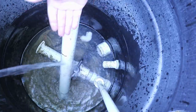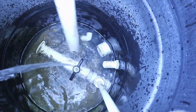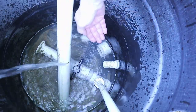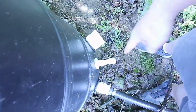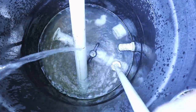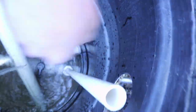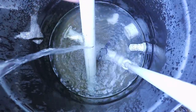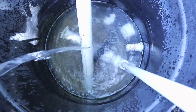But I was getting a lot of biological debris down through the penstock. The bottom of this pipe here has a bunch of holes drilled, but they're not covered with a mesh. That little pipe there is covered with a mesh but it's not connected to anything — it actually goes to a secondary drain I had hooked up for initial testing with a garden hose only. Back to the biological growth: I think what squirrels have been doing is, through this overflow, they like to stash their nuts. I've been getting a lot of nuts in here, and a couple times they would go down and clog up my nozzle. I really don't want that to happen, because if the water stops flowing and it's below freezing outside, I'll freeze the penstock and burst it.